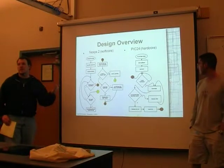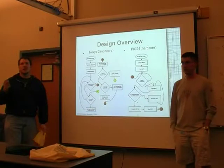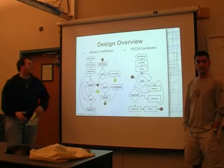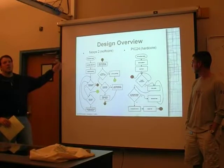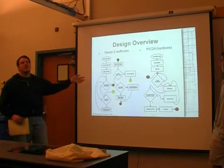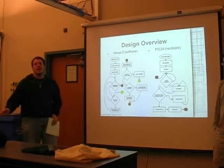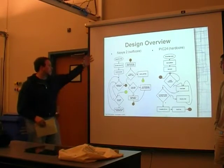Like I said, I have a buffer for taking the scan codes during the interrupt handler, and put those into a buffer, and then basically continue on doing whatever I was doing. I've got a main loop that basically cycles through those scan codes and filters out what key was just entered. It does a lookup table to find out what key it was, and then puts that key into another buffer to be output to the UART. That's basically what all this is here.